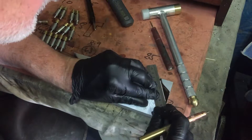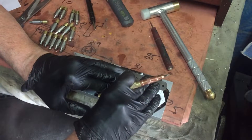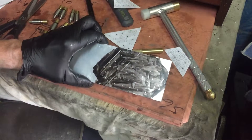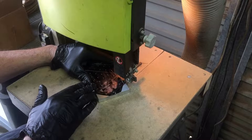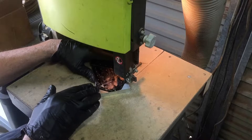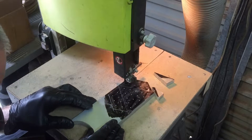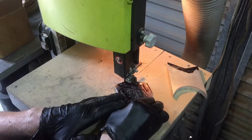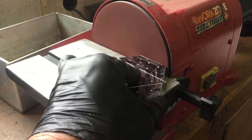I'm going to scribe both the outside of the shape that I've designed, and then put a scribe mark for the triangle, which is the game part of the game. Those outside holes are just for putting the pegs once they are removed from the game part of the board. The simple hobby bandsaw cuts the aluminium quite happily — just got to take it slow and steady. The bandsaw leaves a fairly rough cut, so just a few passes on the sander fixes that right up and makes the face nice and straight as well.